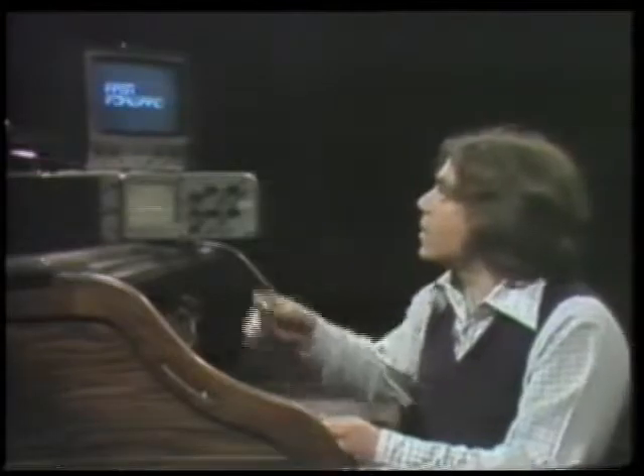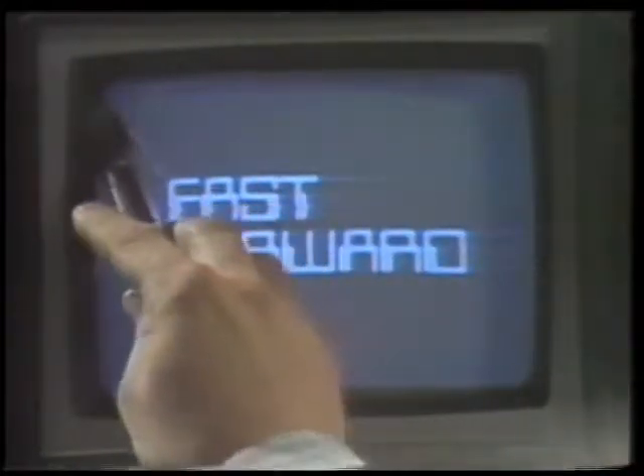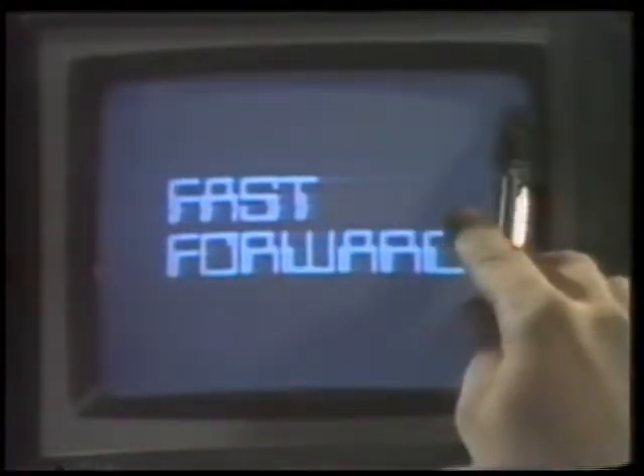The way used in all systems is simply logical. It starts up at the upper left of the picture, moves across to the right, blanks out, goes dark, jumps back to the left rapidly, and begins another trace and continues on. In our system we use 525 of those scanning lines. Some systems use 625, some use 819, some use 405. Notice that they all use an odd number of lines. That's because in television systems the scanning is interlaced.